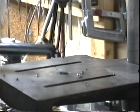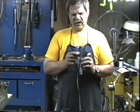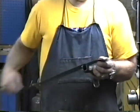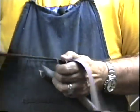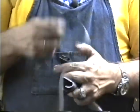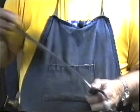There's the other one. These are the holes that vent into the fork crown. At this time, you should take your fork crown, and there may be burrs left inside there from when you ran the die grinder inside that socket. So take an 80 or a 100 grit emery cloth strip and sand any burrs out of there that happen to be in there.